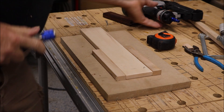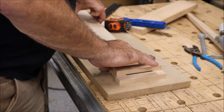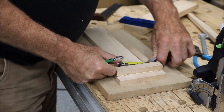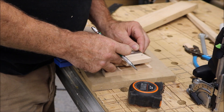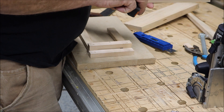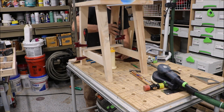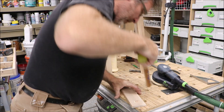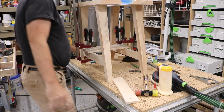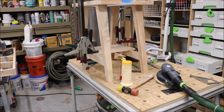The next thing I did was build another small jig so I could set up the shelves and get a four millimeter cut that was the same distance from each end of all eight shelves, set up centered. Just another quick dirty jig, but now I know that I got all eight of them identical. One of the last steps was just gluing up the shelves. At this point I had finish sanded all the parts before glue up, and then I just had to do a couple of touch-ups, check out any glue squeeze out, clean that up. Then I could just clamp it together and I was ready for finish.